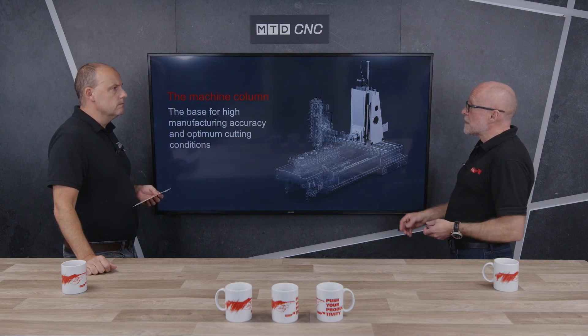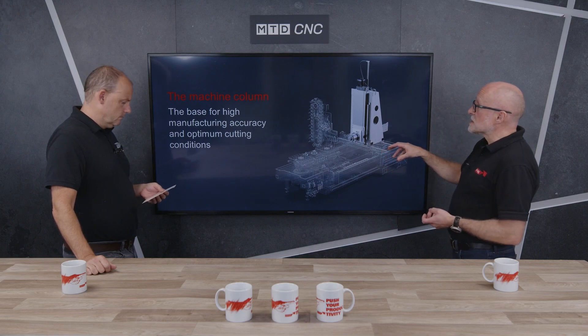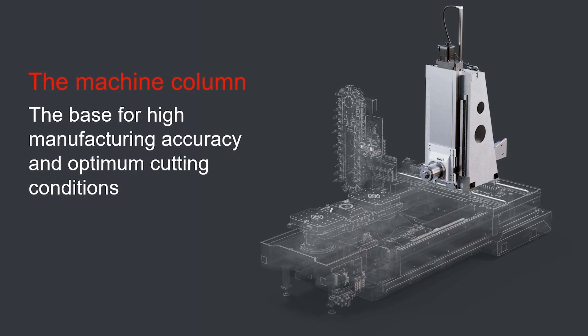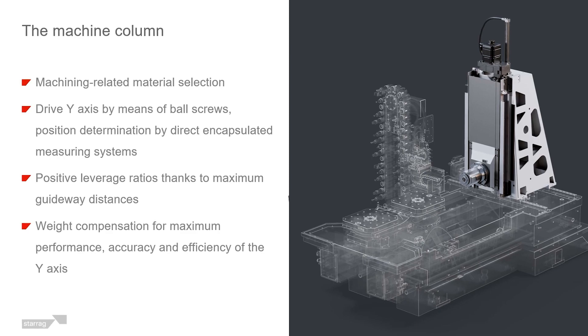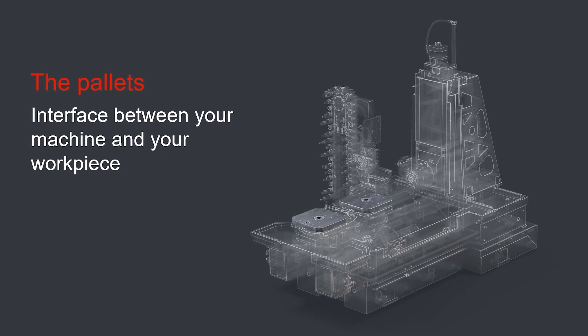The chips take the heat with them. The column then sits on the base. Linear rails and direct measuring systems run across the whole machine. The spindle group, as you can see, is horizontal and sits inside the column. There are various different spindle designs, which we'll touch on in a minute.